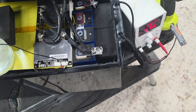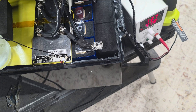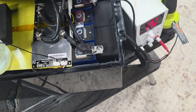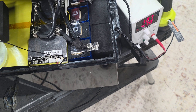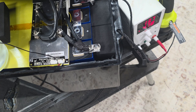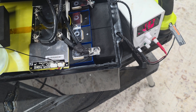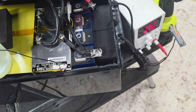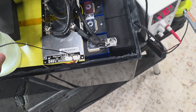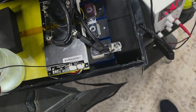So that's my teardown. The wires are pretty good, the welds look good, the cells look good. I just think the construction could be dialed in a little more, and the temperature sensor should be mounted somewhere where it can actually read the temperature of the cells instead of the fiberboard. It doesn't seem to have low temperature protection. That's the model of the BMS — it says it can do 200 amps, though I haven't tried it and don't really have a way to test 200 amps.